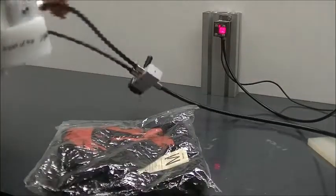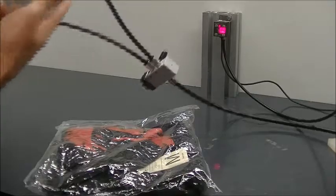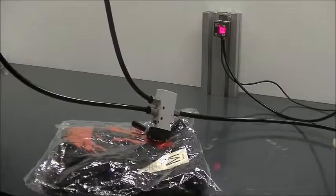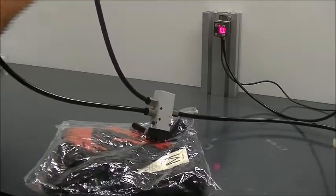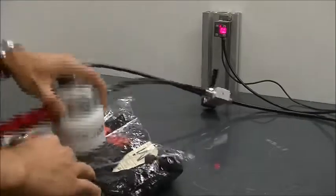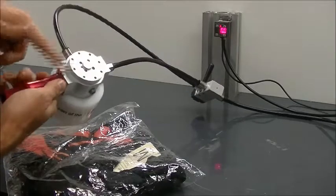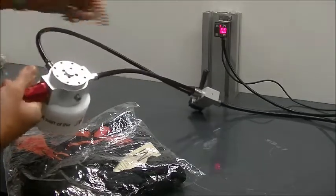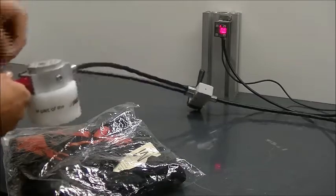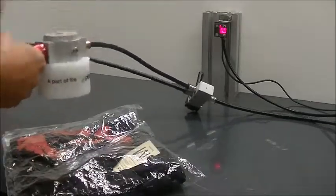The product here is a Kinos gripper — it is a sack gripper mini. You can see the inside: there's a nice planar surface that can suck the bag up and create a seal around this plastic piece, allowing vacuum on the product. Compressed air goes in the front through the coax cartridge to generate the vacuum, and then out the other side a blow-off releases the product. Without a blow-off, the product will stick to the gripper and have a hard time releasing.